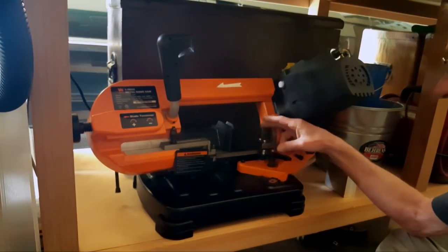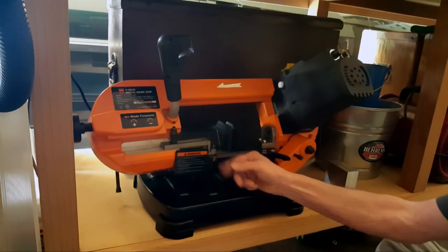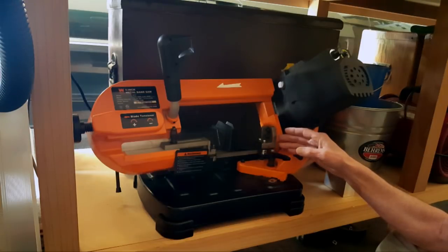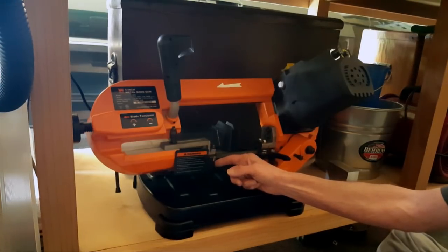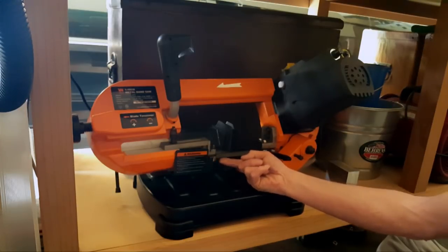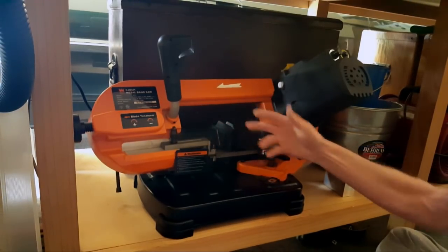So first thing you do is you think, well, maybe I have to adjust the rollers. It's pinching the blade too hard and pushing it out. Don't know why it's not doing this side, but okay. So now experimenting with these rollers. First thing is it's two rollers. They're independent, and they're press fit onto this bolt. And the bolt is shaped like a cam. So if you put a wrench on the bottom and you turn it, the bearing will go in or out of the blade. So now you start wondering, how am I going to center the blade up?